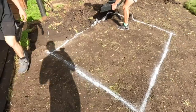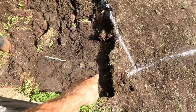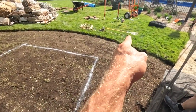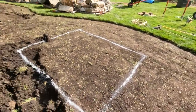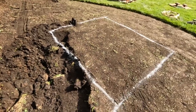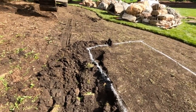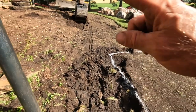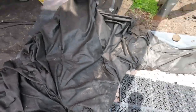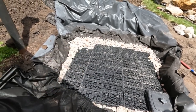Here's the footprint of our 12 large aqua blocks. We're going to shift it just a little bit — we've got some electric that we're going to have to pay attention to. Looks like it comes out from the house and ends up going over to an outlet back there, so we'll just hand dig this corner. Dan's up top in a very large machine for a very small hole, but that's okay. We'll go ahead and get this thing dug, carve back another wedge, make sure our aqua blocks and everything fits, and then start shaping out our pooling area. Reservoir is in, there's our pump vault — that will house our pump. We got our 12 aqua blocks, over-dug, and then filled with cobbles and some large gravel all the way around.